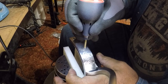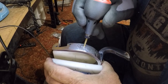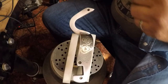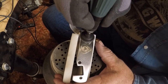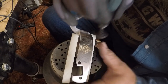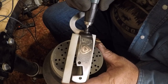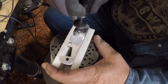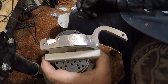When you cut those undercuts it raises the edges of the steel up around the channel. When you're hammering the fine silver down in there, you're also flattening those raised edges back down. Here I've taken my orbital tool with a disc — I think it was 220 grit — and I'm sanding over these, hitting the silver and the raised edges, evening them out down flat and even with the top of the spur band.